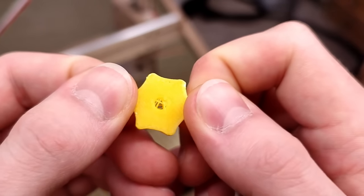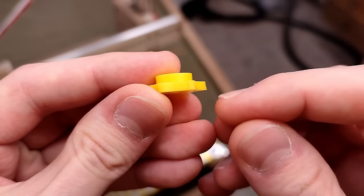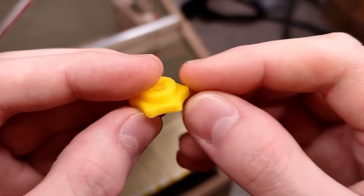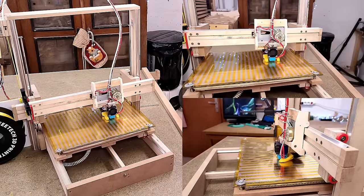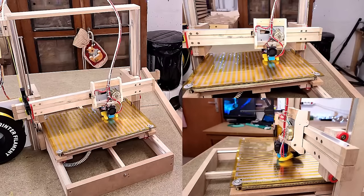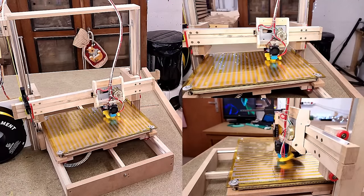Pretty good, I'd say. Whether that is thanks to the improved part cooling, I don't know, but it does have barely any layer shift from bottom to top, which is definitely because it's so small. So, same thing again 3 more times, I guess. In case you're wondering why I'm doing them all separately, well, if I did them in a single print, each layer would take 4 times as long, consequently, I would end up with 4 times the layer shift.